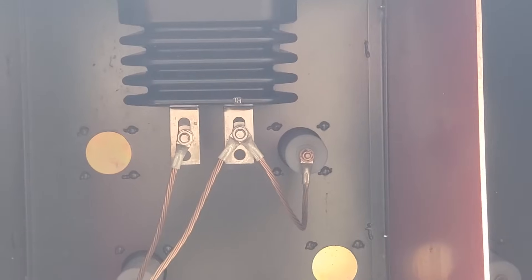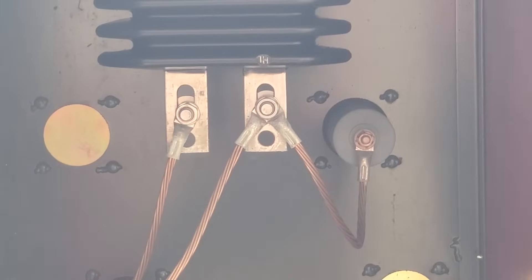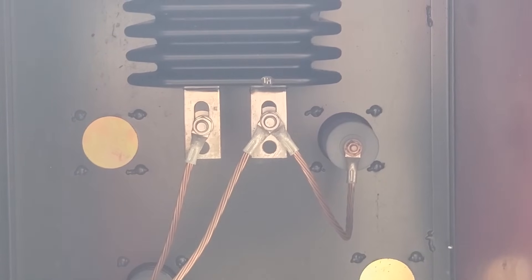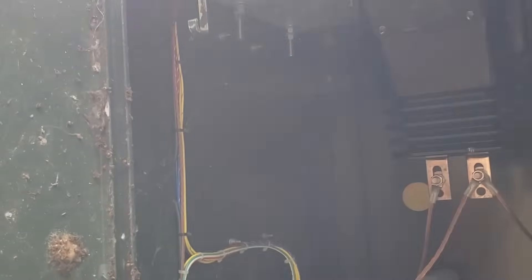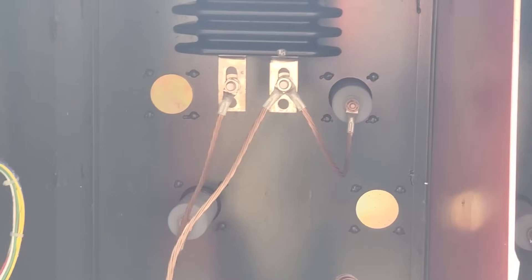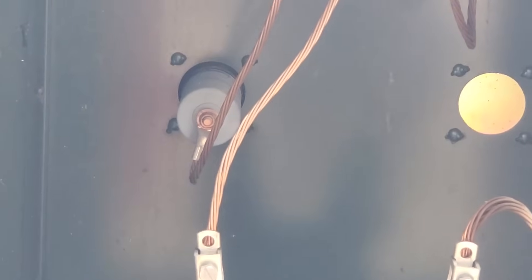You can see where the 7200 volts comes out on that bushing and goes through that high voltage CT. The bar type is coming in on the right hand side and coming out on the left. Those two leads being that close together are at the exact same voltage, but it's measuring the current and transforming it down to a readable level. I'm not sure what the ratio is on this unit, but it's going through those real tiny little wires through that pipe over to our transformer-rated meter. Once it goes through the CT, it carries back out to that bushing on the other side.